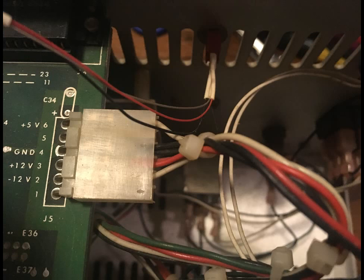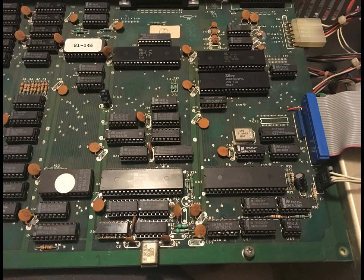As you can see in this next picture, I've done a pretty good job of restoring it. I had to place a couple new sockets in there, and I'm going to need to get a couple new ICs, but for the time being they're at least back the way they were supposed to be. There's still that one red wire coming out from where the floppy connector is. The reason for that is it's actually hard-soldered on there, and I'd rather have it as an insulated lead than try to clip it off and have it flopping around. But at least the computer looks the way it's supposed to look.